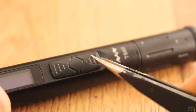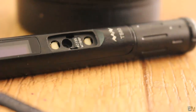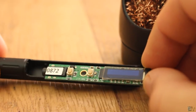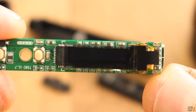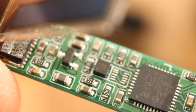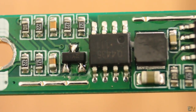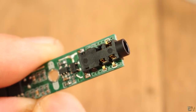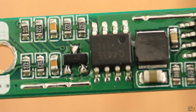Now let's open it. To do that, you first have to remove the button cover, then using the included allen key, open the case. The top part will pop out and here is the ultra small PCB that does everything for this unit. On the top part we have the OLED display, the STM32 microcontroller, the buttons, and what I think is the accelerometer for sleep mode detection. On the back we first have the USB connector, then the buck converter that supplies the digital components, then the MOSFET that provides power to the heater, and the op-amp for temperature sensing from the thermocouple, and of course the 3.5mm jack. Some tracks with solder must be for the power that goes to the heating element inside of the tip. I'm still amazed how small this is.